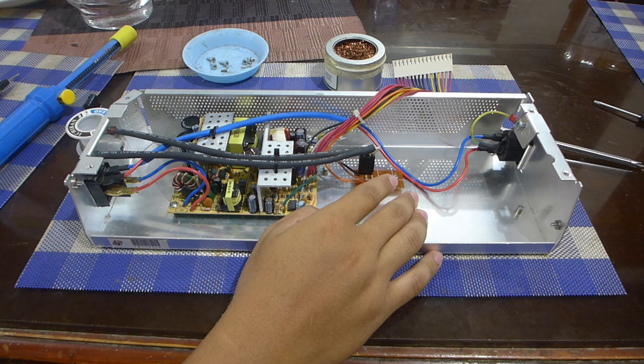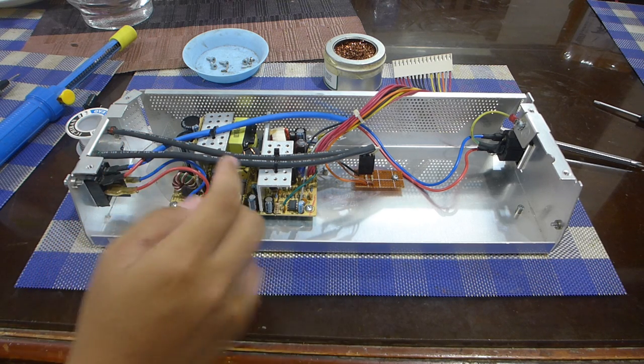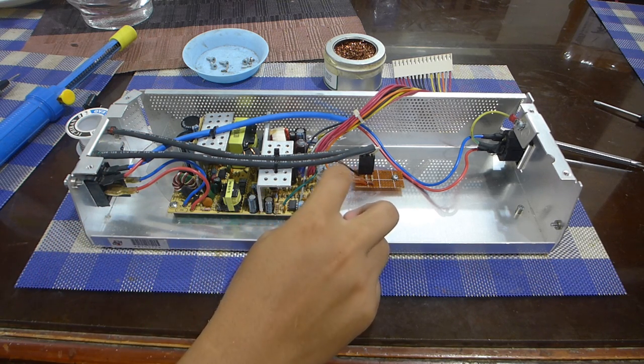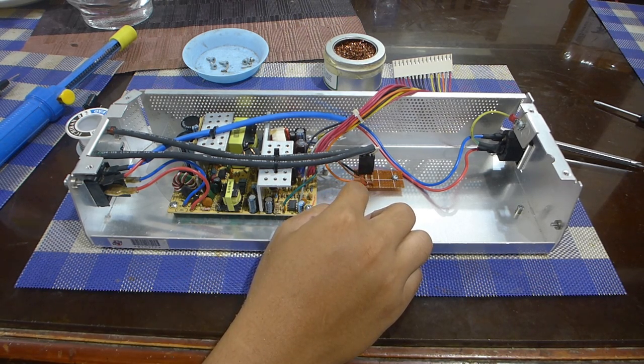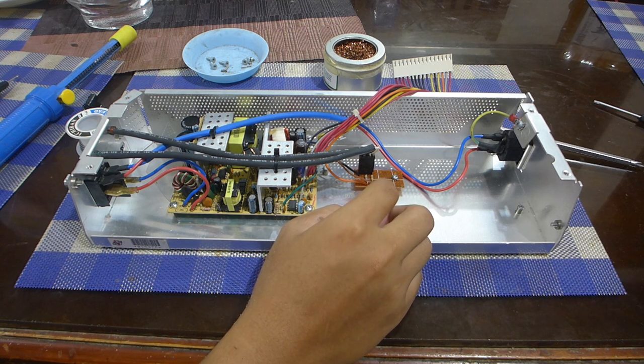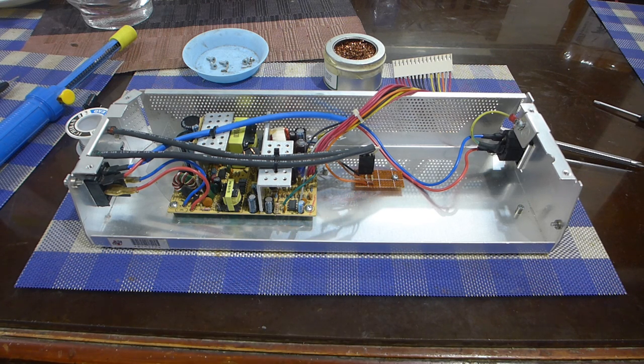I've already mentioned the LED board here for driving the LEDs on the power supply, with the orange cable repurposed for the hard drive activity light, which pulls down when it's active. So it's connecting to the anode of the LED wire, and then putting a 75 ohm resistor there, just in case, as per the way it was wired on the original power supply. So yeah, I think it's pretty much set. I just have to do a test run.